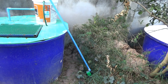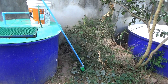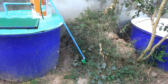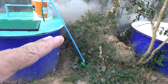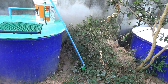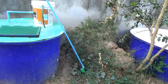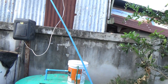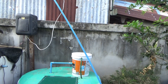What that means is this pump can pump 1800 liters of water with zero height at ground level. As soon as you need some lift, you need water to be higher, the liters per hour goes down. This one claims it can push the water all the way to 2.4 meters — that's really, really high. That's how long that blue pipe is, 2.4 meters.